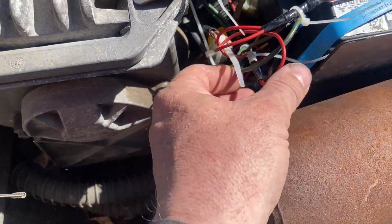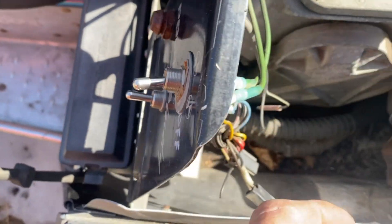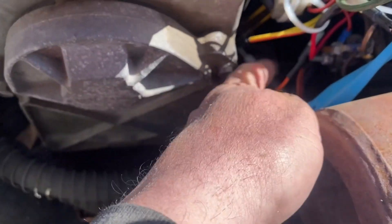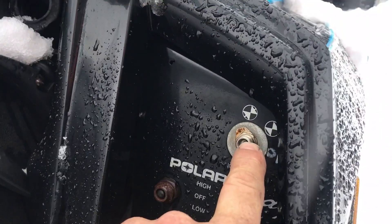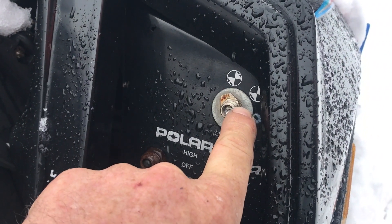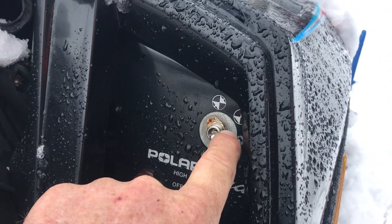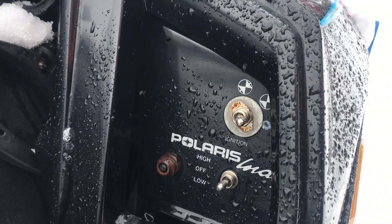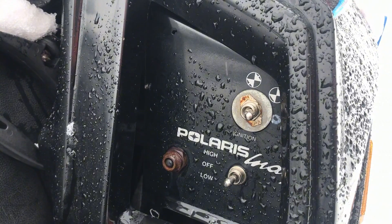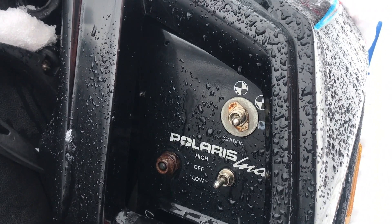To bypass the ACS, I ran power from the battery up to a switch, and then it goes back into the orange wire here, and that runs into the harness. So when I flip that switch, it wakes up the computer. It's important to note that this switch, which turns on the computer, only needs to be turned on and then you can turn it off again. What it does is it wakes up the computer for about 10 minutes. So if you've been running the machine and you turn it off, you should be able to start it up again within 10 minutes without having to flip that switch. Which is also why I want to put a light here, because I have the habit of turning things on and leaving them on — I left it on overnight and my battery's dead.